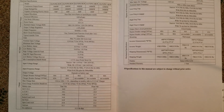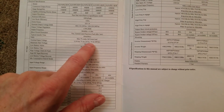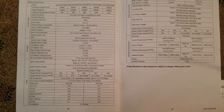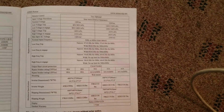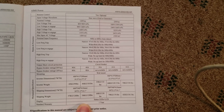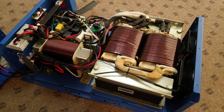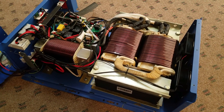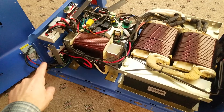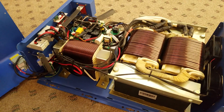Here's a quick look at the specs page. My unit is the 10,000 watt version. For the DC section, it says to multiply everything by four to get your numbers for 48 volts since it's given in 12 volts — this instruction book covers several different models. Over here is information on the bypass and protection, including voltage trip ratings. This weighs close to 150 to 160 pounds, so it'll take two people to lift. If anybody knows what the pump input and secondary transformer are for, I'd love to know — please let me know in the comments. And don't forget to like and subscribe.